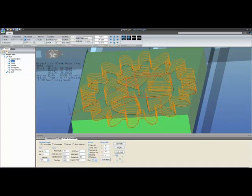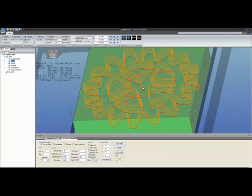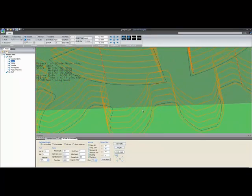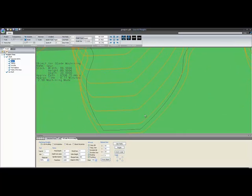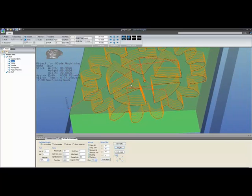You will find a setting in here, for example, for final pass. That's not something that's needed when you're contouring, but if you were to put a final pass, you'll find suddenly a final tool path being generated of a small size. Let me give it a final pass of 0.5 millimeters here. Hit a regen, and you can see another path has just appeared, so that our final path is only half a millimeter in this case. Again, normally you'll leave that at 0 until we have the capability of pocketing things, which is where that can become important to give you a nice smooth finish.